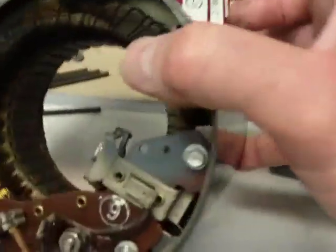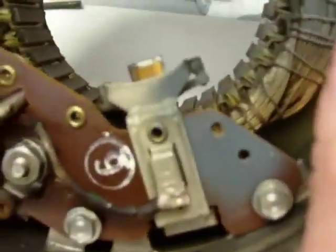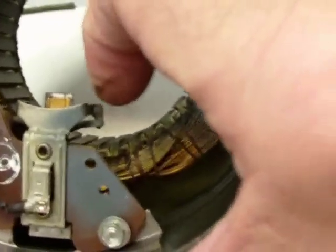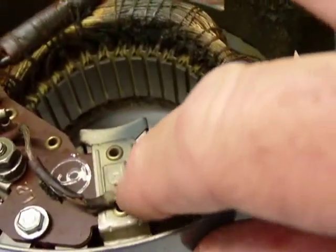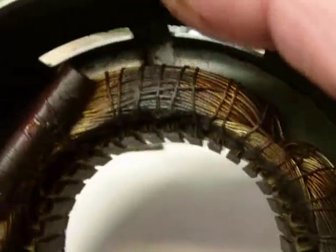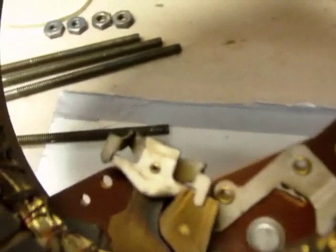What's of interest here is the start switch — this mechanism right here. That is part of the switch mechanism, and that's where the contacts get pitted. There's also insulation on the wire leading to that switch that is burned and actually bare at one point — I can fix that. It will slide off with this connector, and the switch will come off. Looking from the inside, you get a better picture of the switch back there.